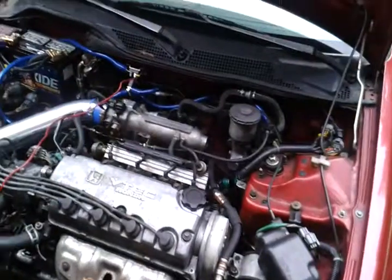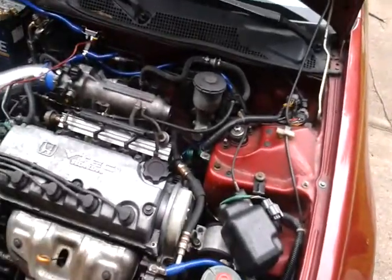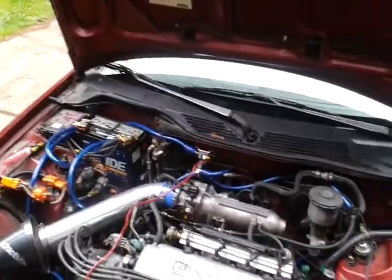With that Brutus thing, I'm looking at getting into a Brutus 2400D. I was looking at SoundStream too, and I like Power Acoustik stuff, even though everybody calls it swap meet material, ghetto Louis. But for the most part, I like their equipment. When I started looking at it, it didn't seem like the power capabilities were going to be there. When you're only running 4-gauge wire and you've got 150 amps worth of fuses, there's no way in hell you're going to pull the RMS wattage that they say they are. So, phooey on them.